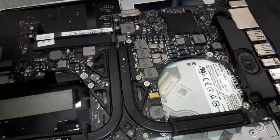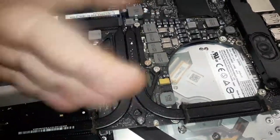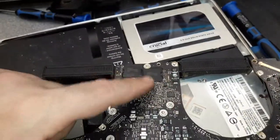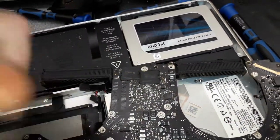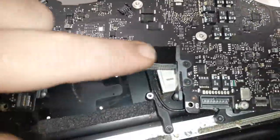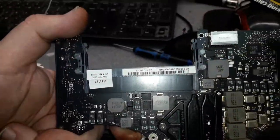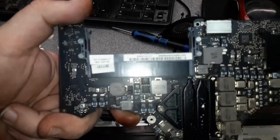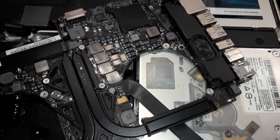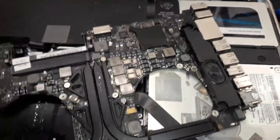What we're going to do is take the heat sink out, take the pads around the GPU, clean everything, use the air compressor to remove every single bit of dust from the GPU, remove the glue on the side of the memory, put some flux underneath. Clean first before doing it, then we'll see how the machine responds. There's no serial number here - I don't know why. There are stickers on the board with serial numbers. As you guys know, a reflow is not the solution - we should change the chip and put a brand new chip, but I can't get a brand new chip. I don't want to waste my time reballing the chip since there's nothing wrong with the balls, so let's see what we can do.